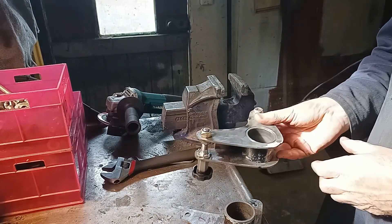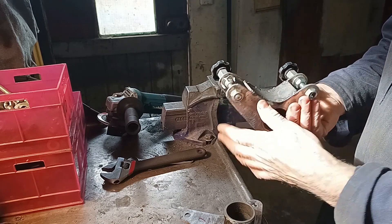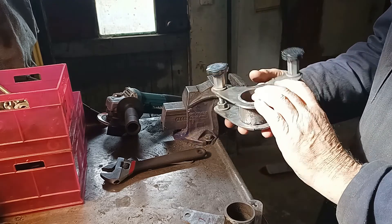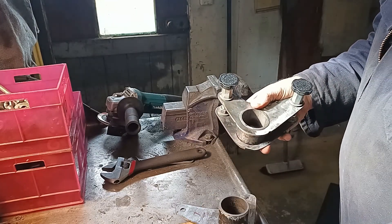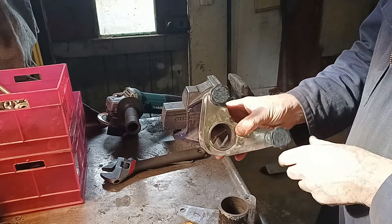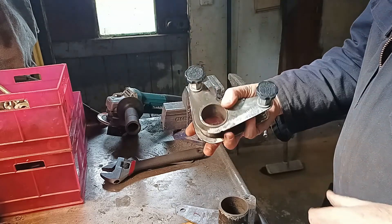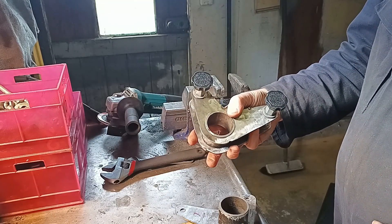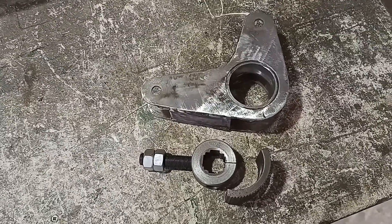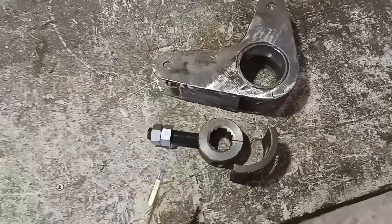You can see how it's coming together — it's just lightly tacked at this stage to gusset and box the bell crank using these parts cut from the old blanks. Don't worry about the knobs; they're just part of a jig holding it all together. There's the bell crank welded together — the welder was a bit wobbly and I lost my way a couple of times.